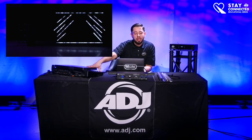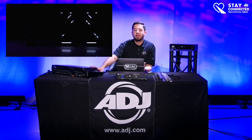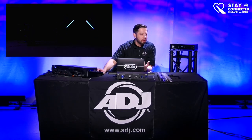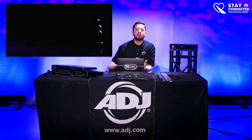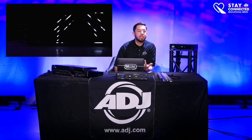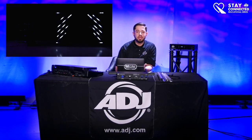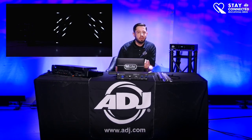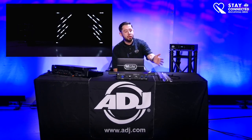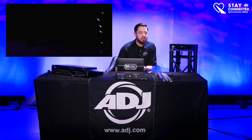So I know a lot of you are like, well, obviously that's not going to be pumping Kling-Net out. Some of you are looking at it like, well, obviously you're going to take a look at the streaming ACN and your ArtNet side of things, but I'm sure many of you are thinking to yourselves, how is he going to do something with the full effect as what he's showing here, because of the limitations that we have, of course, with the universes and overcrowding them with channels due to the fact of each LED being 3 channels. You're looking at your 30, your 60, and your 120, you're obviously going to fill up quite a bit of channels on a universe with just 2 units.